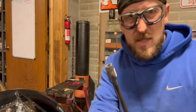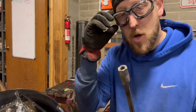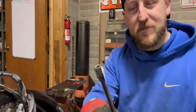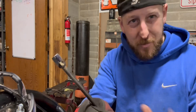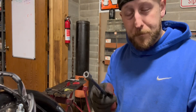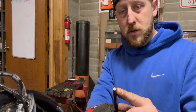So this is what I've built — essentially a union that's 8x1.25. I could have just bought one from the hardware store but they were out of them, so I had to build one. I took three nuts, welded them together with the bolt in the center, then re-tapped it to make sure everything was okay. Then I've got a piece of flat stock — 5/16ths. I tried running a die over it to make it 8x1.25 but the threads got screwed up, so I just ground them off and welded it in. This is going to thread onto the booster with a lock nut.